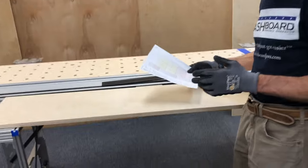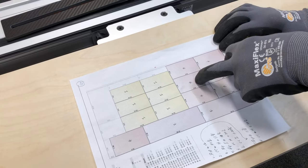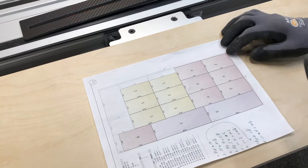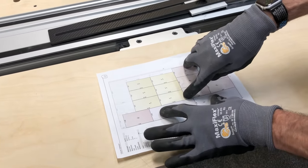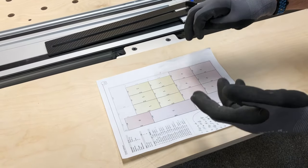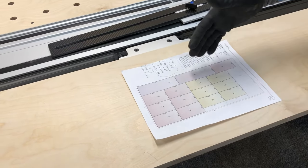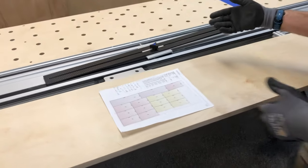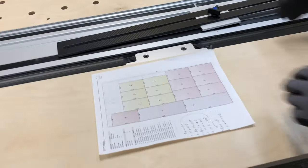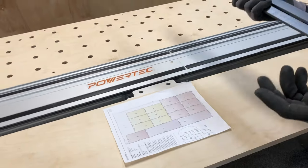In this particular cut, as you can see on this sheet, I've got one long narrow section and two wider shorter sections. I want to cut this off first, but I can't just make a cut here because I'll run into the other part. If I turn this around so the narrow piece I'm cutting off is on the table, I've got this huge wide section hanging off that I can't reach around. So we're going to switch it — the part I'm cutting is going to be on the right of the saw blade — and for that we use the rip gauge in its second capacity.